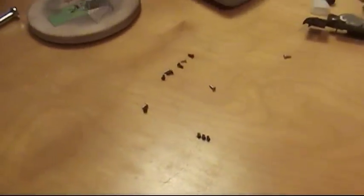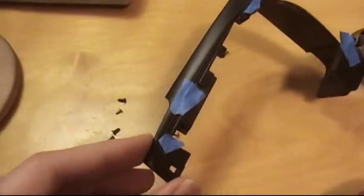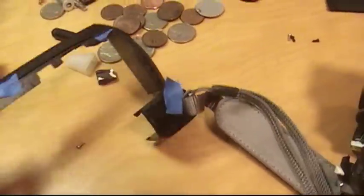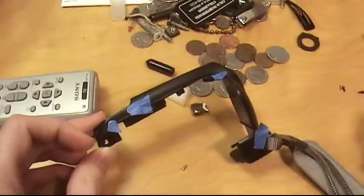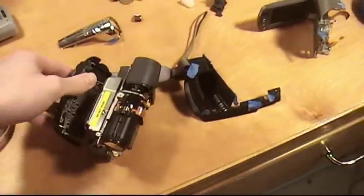What I'm doing is, as I take off screws, I'm matching them up with ones in that pile and then using masking tape — preferably painters tape — little pieces, putting them on the trim pieces where they go. You can see I taped the screw in its spot on the frame piece. After you take each frame piece off, put the screws there so you remember where they go, because after a while there's gonna be a lot more screws than you think. I got all the screws marked on there.